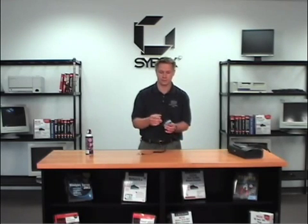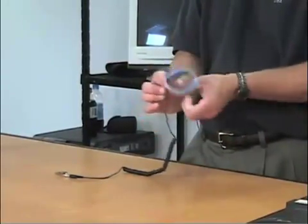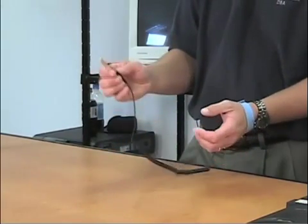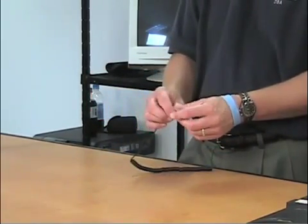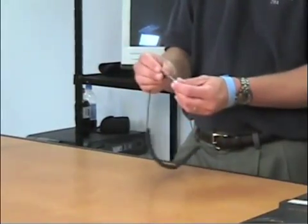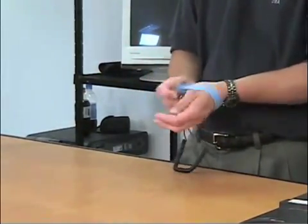Legacy equipment is far more prone to static discharge and damage than newer parts are, but just as standard practice, make sure that you're very, very careful with that. Always use the anti-static wrist strap as well. Again, we saw this in the toolkit section. You've got a resistor that will be there. Put that against your wrist. That's the way that it goes. Connect this either to the chassis of the computer you're working on, or again, pull off the alligator clip and connect it to the electrical outlet ground there.